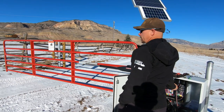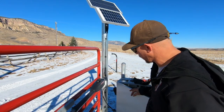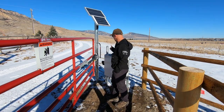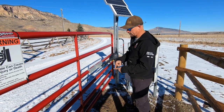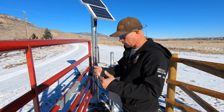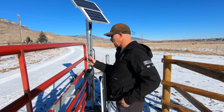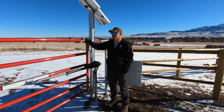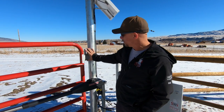Anytime you put a new board in, we have to relearn the limits. One thing to note: when we drove this post, we thought four and a half feet would be fine, but we didn't realize how much torque was on it — it wanted to spin even at that depth. We ended up driving some pipes crossways and welding them, and then added anchors driven at an angle and welded to the bottom to keep it from spinning. In the future, we'll weld flanges on deep inside the post before driving it so it can't spin. If you're going to drive a post, think about the torque.